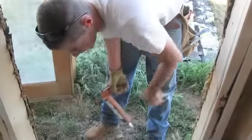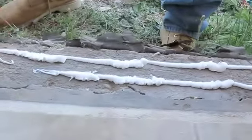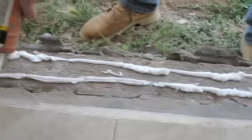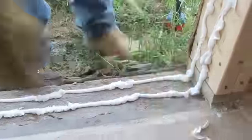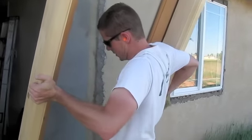You're going to want to put two beads of caulk here, and that's actually to keep water from running back into the house. I usually make a solid two bead line of caulk and it kind of double reinforces it. It also helps keep bugs out of the house as well. Since I have my caulk in place and I checked to make sure the door fits, I can go ahead and install it.